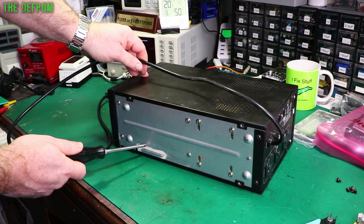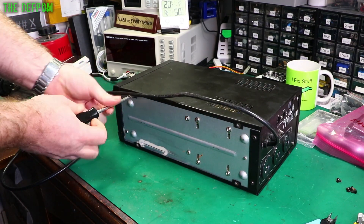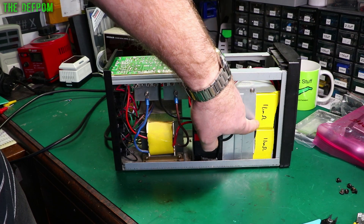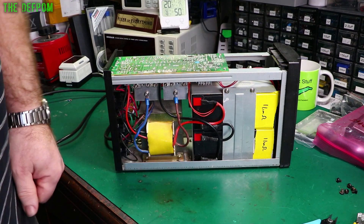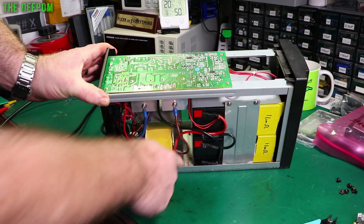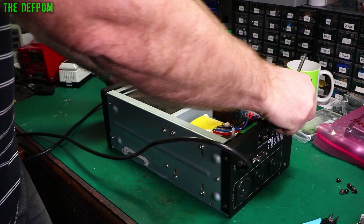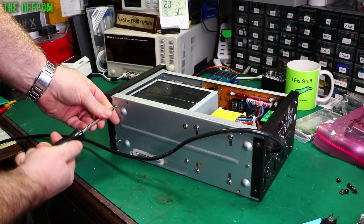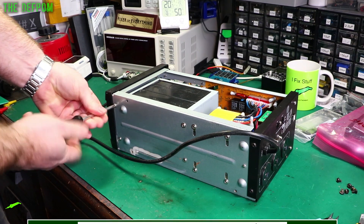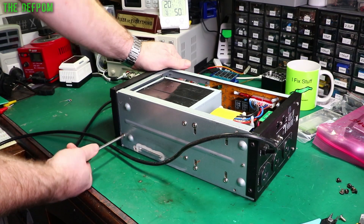Here's some clues — that looks like a leaky battery. On here I noted 11.7 milliohms — that's the resistance I measured on these batteries when I installed them. And yep, there's definitely a lot of leakage going on down there. You can see all the residue inside. One of them has definitely failed. They look like 7.2 amp-hour ones. There's the bracket that holds it in — I'll get these out and free them from the bracket, and unplug the power from the batteries.